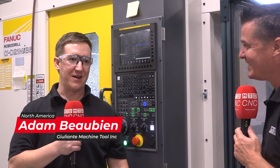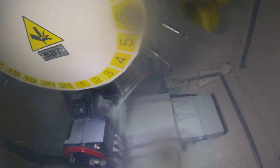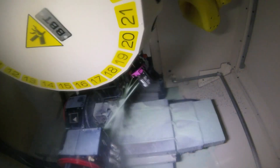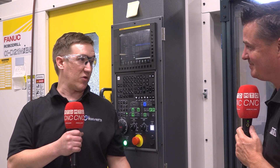I was totally skeptical when I saw these little tool holders and little retention knobs and everything. I've seen the YouTube videos, but you got to show me — I got to see it before I believe it. Still getting my feet wet, but I've seen these machines do some stuff I never would have imagined coming from 40, 50 taper machines. I'm pushing three-eighths, half-inch end mills just about as fast, if not faster in some situations. With the high RPM and through cooling, we're able to just push through whatever material we want with almost no limitations.